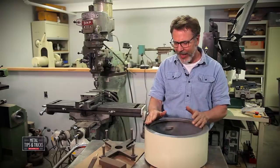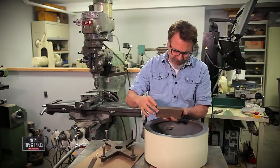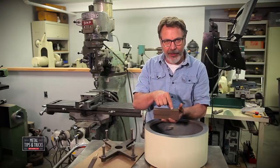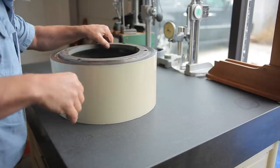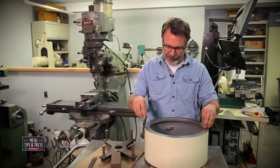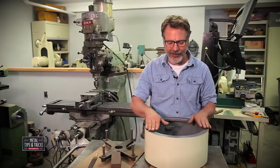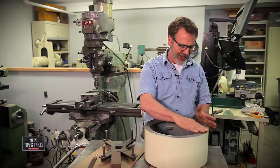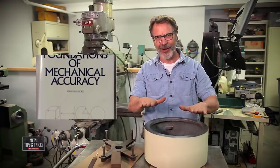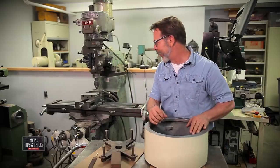I also hinged it. If you don't know what hinging is, it's one way to check that something is flat. If I pivot this on a flat surface and it's flat, it should pivot at about the one-third point. When I did this large surface, I found that wherever I moved one end, it pivoted on the opposite side. So I'm assuming it's flat, though I'm not exactly sure. I read Moore's book — I don't remember him talking about how to check if a cylindrical surface is flat, but I'll look for it another time.